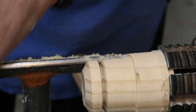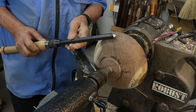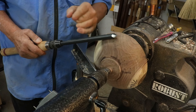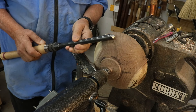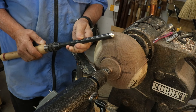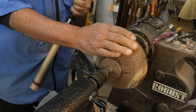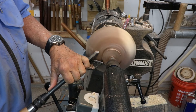Let's move on to the bowl gouge. The next tool is a bowl gouge — it's got a deep flute for ejecting shavings quickly. This is a 5/8 inch bowl gouge with a 40 degree nose angle and swept back wings. I have a nice walnut bowl, so we'll do a demonstration with it.